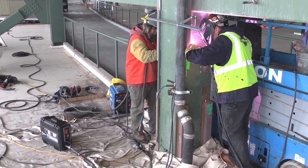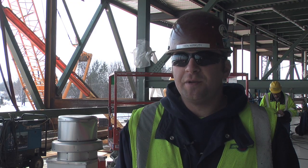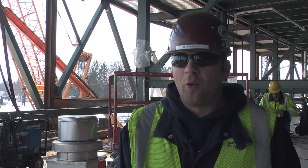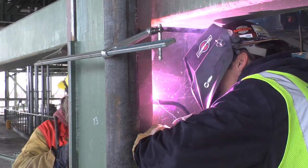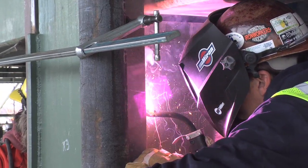Some of the advantages of running the wire are the speed and productivity — you're cutting the weld time in about half for guys who are really proficient running wire. We've got about 30 percent less time with the wire. You can just keep burning it, get a slightly wider pass than with stick, lay down a lot more heat. With wire you have very minimal product loss, whereas with stick you get arc strikes, guys throwing them out, maybe only burning half a rod and having quite a bit left over in a 50-pound rod when all is said and done.